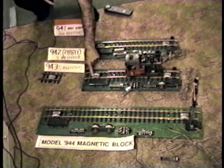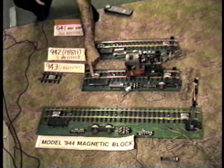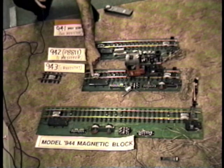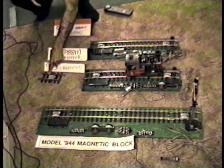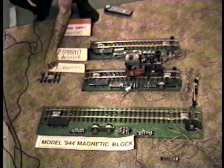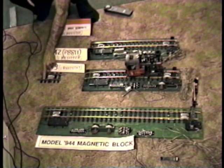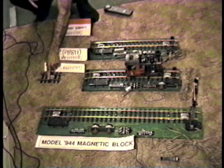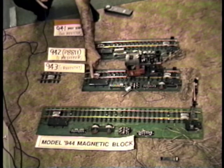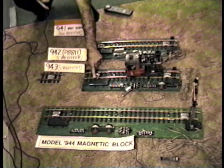This single wire here I'm pointing at, which I believe is identified as wire D6 on the wiring diagrams, we would move that wire back to the far side of this new 1015U, which would effectively start the slowdown block here at this gap. So this thing would be essentially jumpered across, so it wouldn't be a gap track anymore. It would essentially act like a piece of straight track.